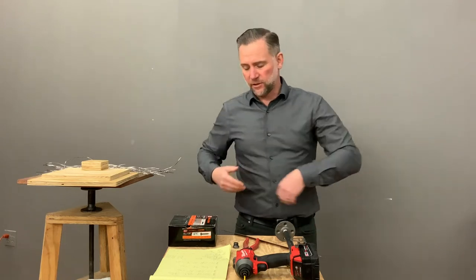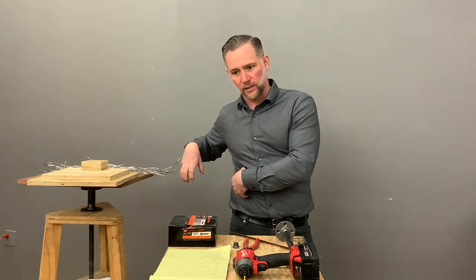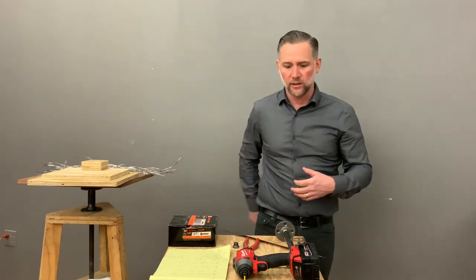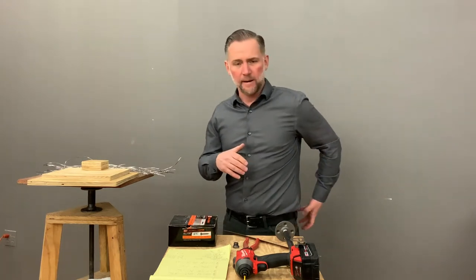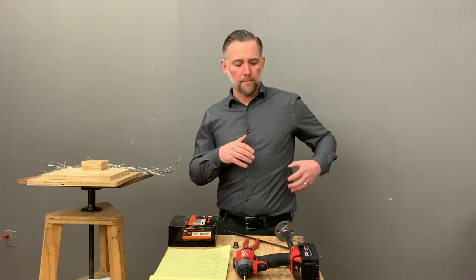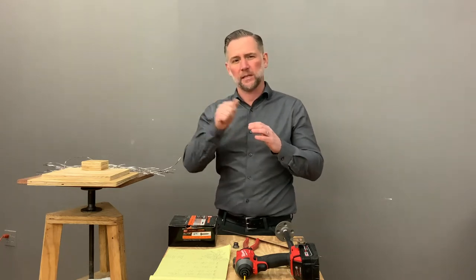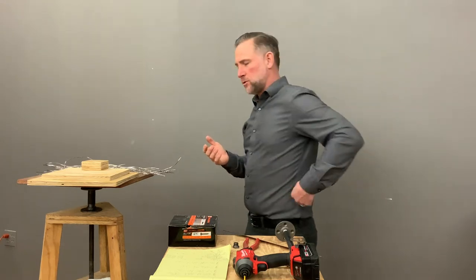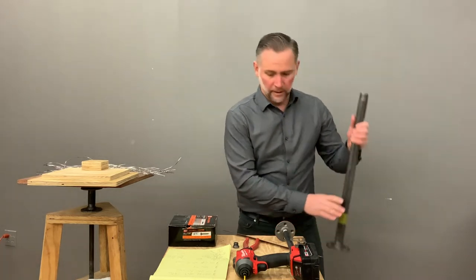So the goal, though, is to have this pipe coming out of a nice flat area in her back. If she's here like this in a crease, you don't want that pipe coming out at a detail section. You don't want the pipe coming out right in the center of the division of the legs. Good areas, depending on the size, can sometimes be the side of the hip or the glute, because those are nice big flat areas that'll be easy to repair in a casting. Usually the back of the lat, sort of here.